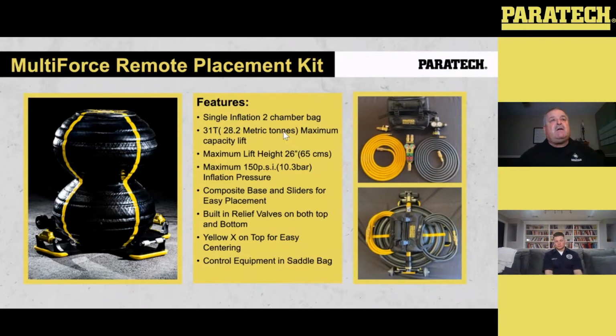It allows you to slide under a vehicle. If you take a look at the front of a semi, the axle is approximately 5 feet away from the front of the bumper. So if any of you have done a lift on the front of a semi using the conventional airbag, you know you're going to crawl under, lay down some cribbing, and place the bags, whether it be one or two, ready to do the lift. But with this, you can slide it under in place, do the lift, and it'll come up, make contact, and at about 75 psi on the front of that 12,000 pound, it'll take it up around 18 to 20 inches. It's a great little tool. As you see in the picture on the left-hand side, it comes with optional flashlights where the lights will point up when you slide it under.